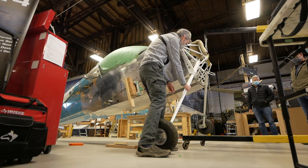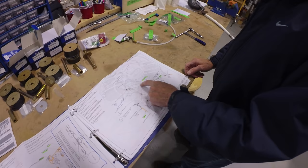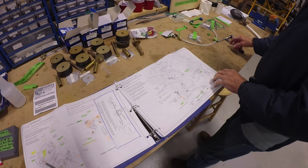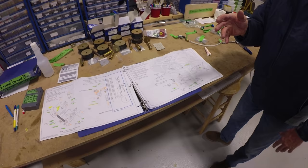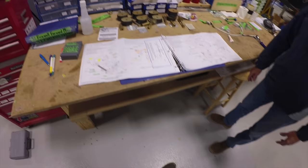This is all the fittings that go on the back case of the engine. They need to be installed — especially that one — before you hang the engine because you can't get at it afterward. The isolator motor mount actually interferes with that. All the fittings on here are identified and ready to grab and install. Once all this is on the engine, then we can hang it. I think we'll have an engine hung today if everything goes smoothly.